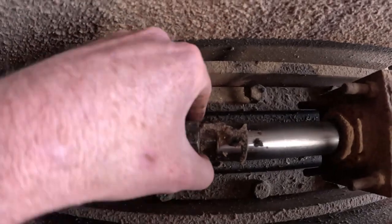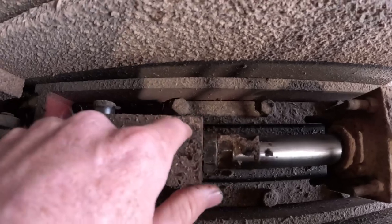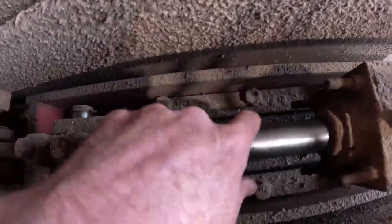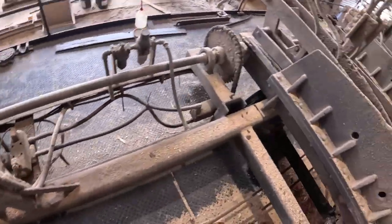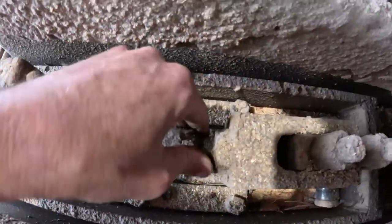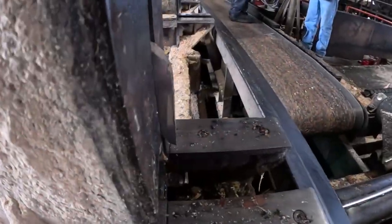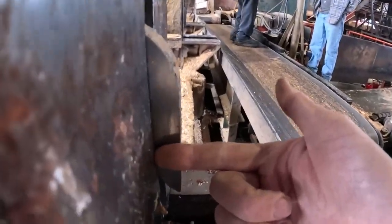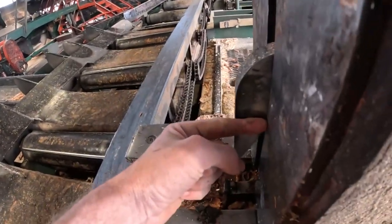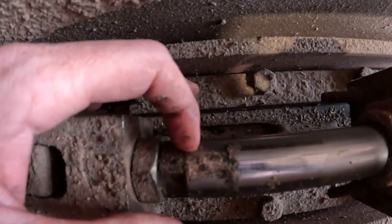The lock nuts evidently came loose, which allowed the cylinder to turn and just continue to tighten itself up. I'm going to put this right against the yoke, onto the shaft where it needs to be — something like this, which is about seven-eighths of an inch off, but we'll measure to be exact. All four of them will be like this, which will have the dogs sticking out the same. It's probably half inch, three-quarters of an inch — probably like an inch. A one-and-a-sixteenth wrench actually goes on the shaft itself.